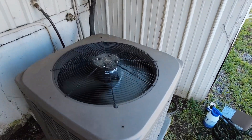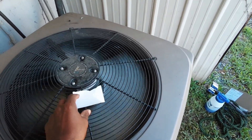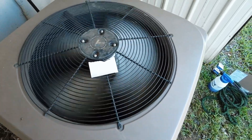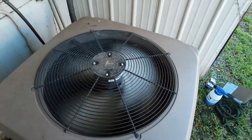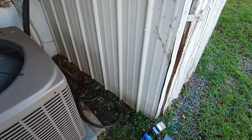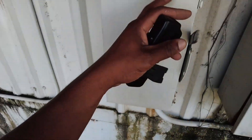I'm not going to waste time showing you the pressures right now, but essentially if it's not discharging evenly through and through, you know your coil is dirty. Not to mention the discharge temperature here is piping hot and you can see it in the shade. Let's go ahead and get the coil cleaned up.